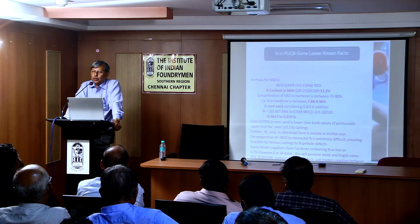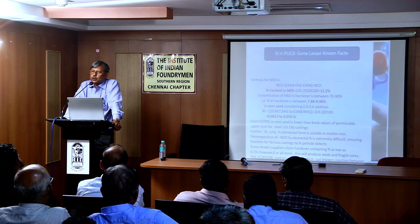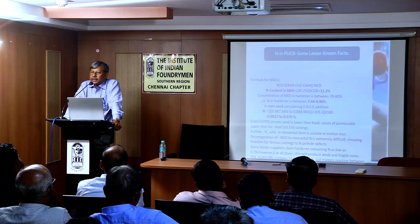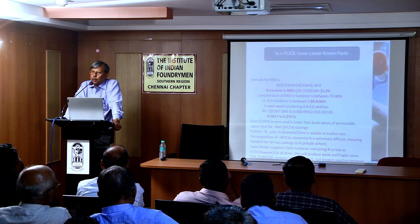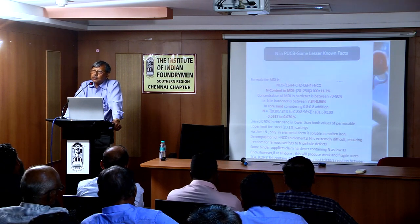You must know the Kjeldahl process, how nitrogen is brought out in the form of ammonia, with how strong a digestion, with strong alkali, and only then does it come out. So it is not that easy. So although it contains nitrogen, that nitrogen is not harmful, and it does not give nitrogen pinholes in castings, unless in rare cases, or it mostly comes from the melt.